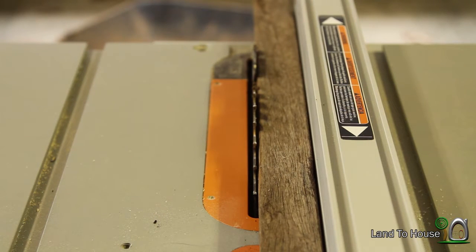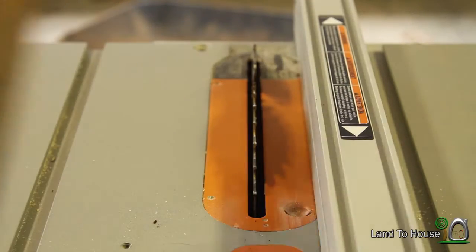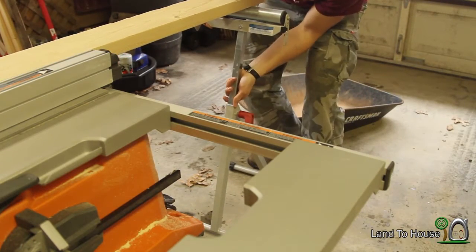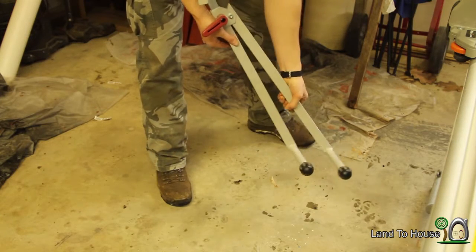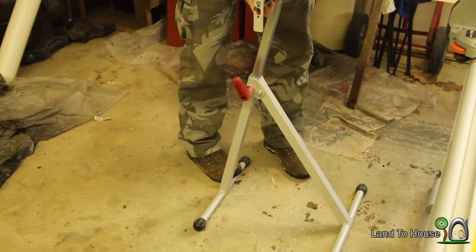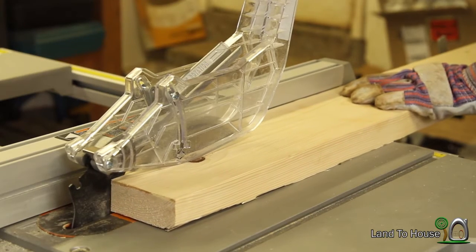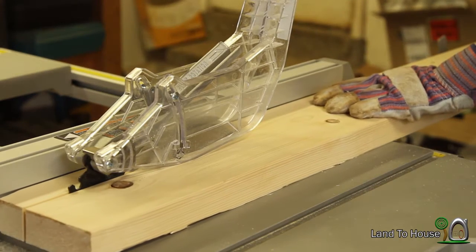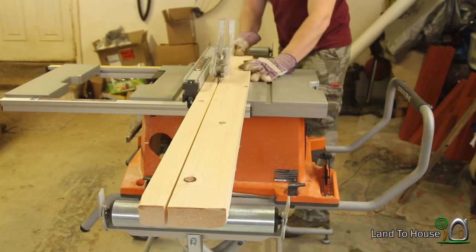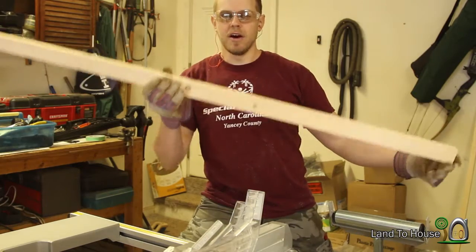You can see we're set up now at one and three-fourths to cut our width. So let's split this board. These rollers support the weight of the wood whenever you're pressing through the saw. There's piece one — looks really nice. Now time to cut the second one. Now we have our two handles already.